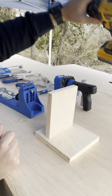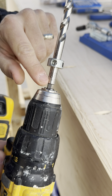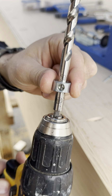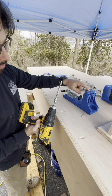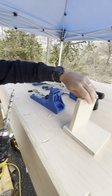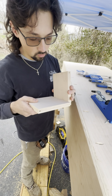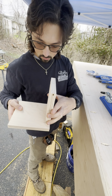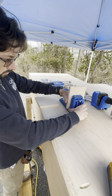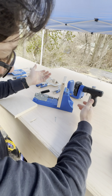And then second thing you need is on your drill bit, it has a little set screw, a little Allen screw right here, and it has measurements on it. So again, I'm using 3/4 inch. So if you could see right there, I'm setting this to 3/4 inch. So after you've got this set to 3/4 inch, which is the board thickness, and you set this to 3/4 inch, which is the other board thickness, then pretty much all you have to do is figure out which way you're wanting to joint it. Do you want this end to die in there? Do you want this end to die in here? After you figured that out, then on this one, you would just set this to where it tightens up tight, push it down in there, and clamp it, and that's it.